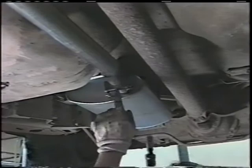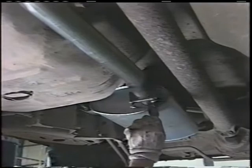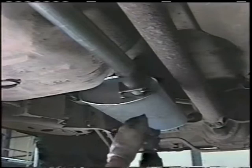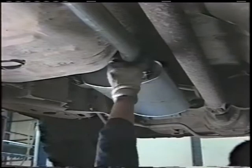If you put it up here, it'll tighten at the end of this pipe that's installed in the muffler. If you tighten that further forward, it'll want to shove that muffler off that pipe. So you want to keep the edge here so it's nice, crisp, and clean. Tighten a little on one side, a little on the other. I'm very fussy, so I want this clamp laying level with this level muffler. Okay, we check clearances to make sure everything fits, which it does.